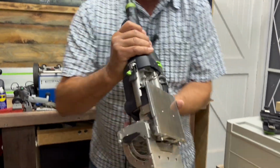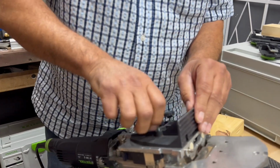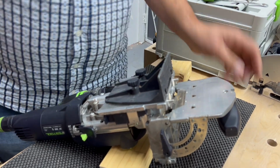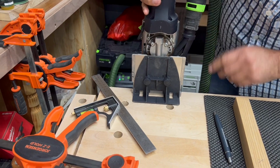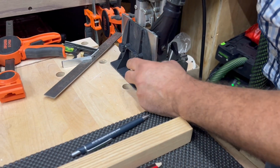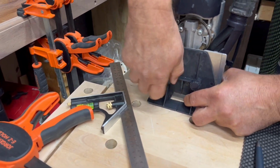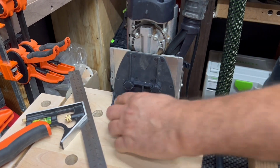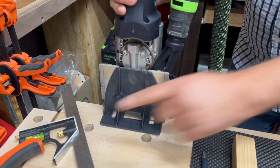together perfectly. What Festool has actually done is they have another base over here, an extension piece, an extension foot if you want to call it that. We look for a nice flat piece of wood. The machine will now rest on that aluminium base. Okay, you take the plastic and you just push that down onto your surface. Okay, and now when you're plunging down, you can actually hold here. So that means that the machine will plunge down perfectly straight. So when we take that,